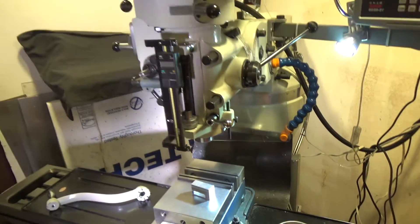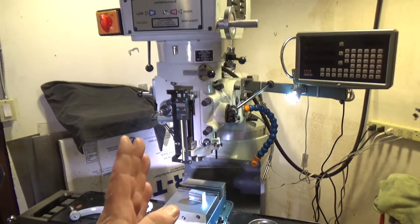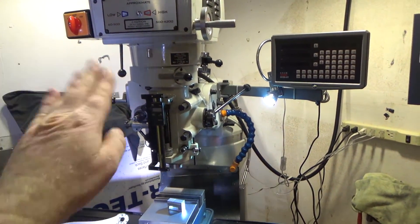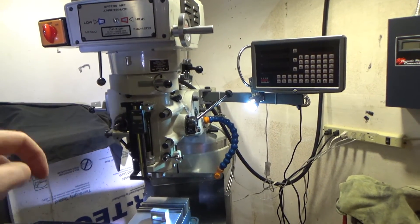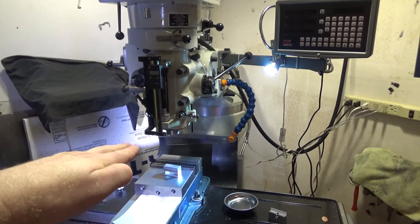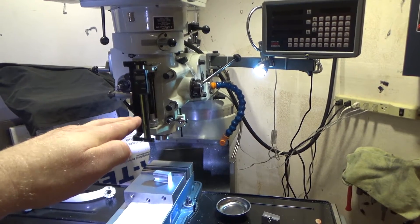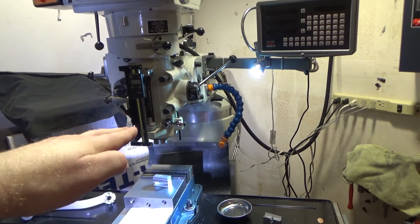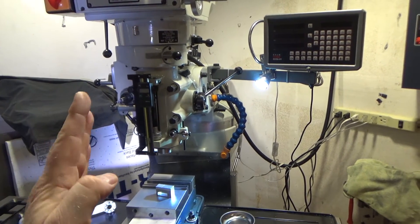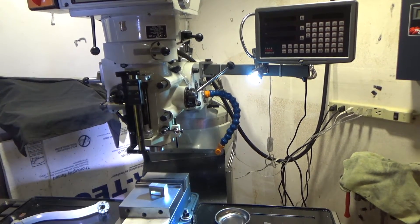One of the normal solutions is to keep the part perfectly flat, load it in the vise with some parallels, and then tilt the mill to either side or front to back. Front to back is a lot harder because the fulcrum is behind the center axis where you're tramming it, so as you try to tram it and move the head back and forth, both sides move at different rates. Left to right is easier because the axis of rotation is right down the center, so if you're up two thousandths on one side, move it down a thousandth and the other side goes up a thousandth and it will be trammed.